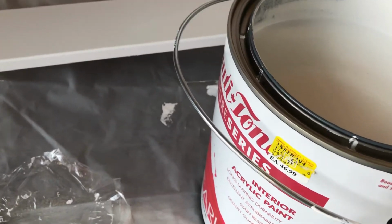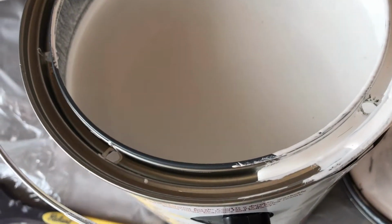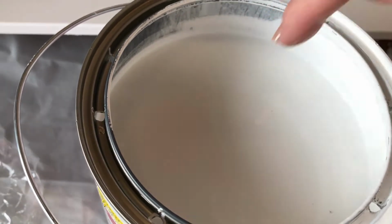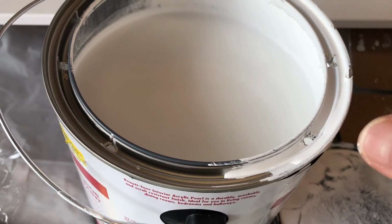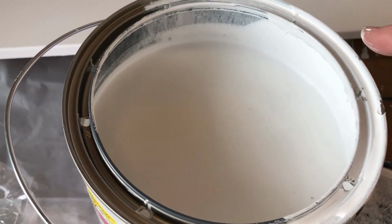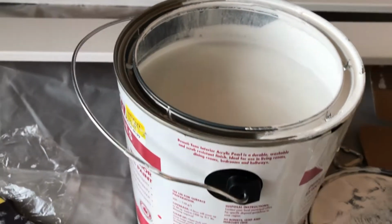And then since it was a bit of an investment, I punctured, can you see? I punctured holes all the way around the inner rim, this part, so that the paint, when you're brushing it or after you pour it, drips back down in there and stops hanging about in this little trough. Because when it does that and you put the lid on, it seals it up and it gets hard, and you take it off and it's all gunky, and you do it again and it gets thicker and thicker till the lid doesn't shut well. And then you get rust and you get air coming in and you get ruination of paint. So that's what I did.